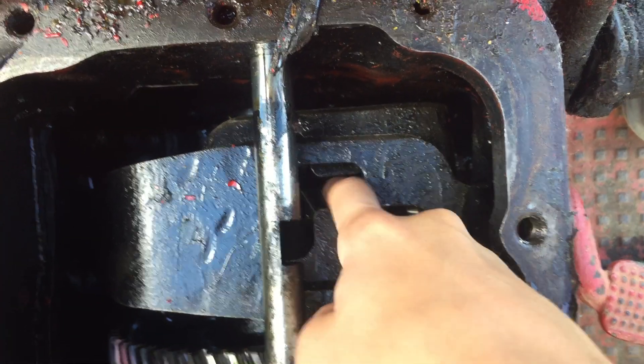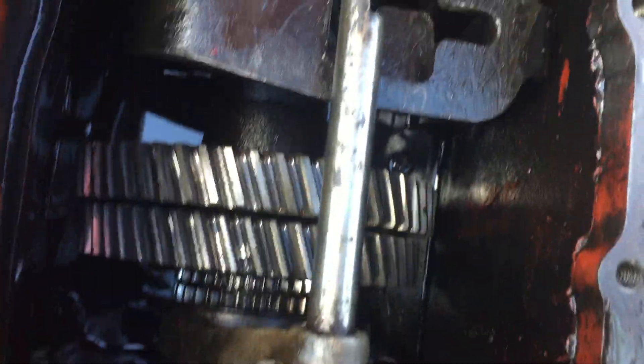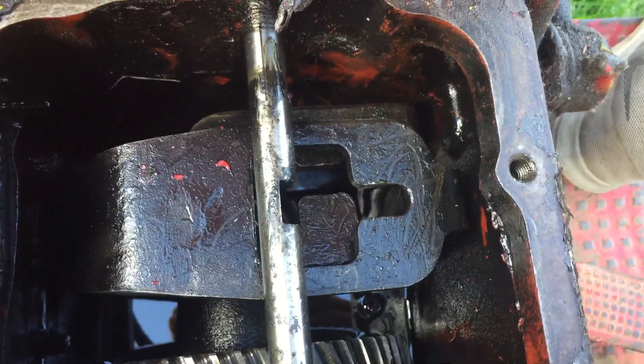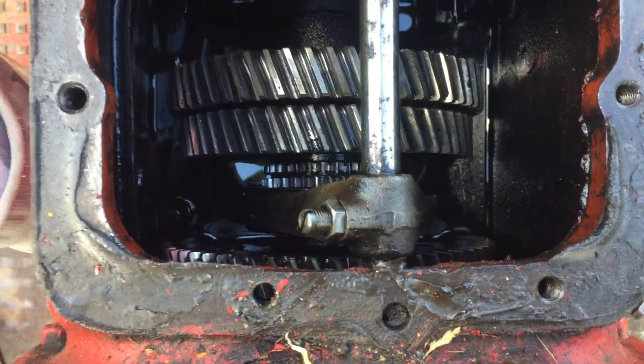That piece has a slot right here — it's supposed to be lined up with a slot right here. So it is stuck in a gear. I've tried rocking the tractor back and forth. I've tried turning the engine backwards a little bit. I jacked up one wheel — I have a bottle jack right down there. And I have just hammered that thing. I've tried pretty much everything in here. It won't move.